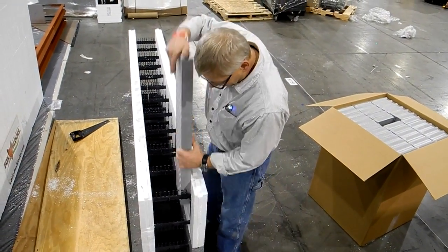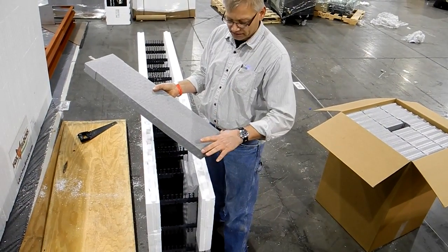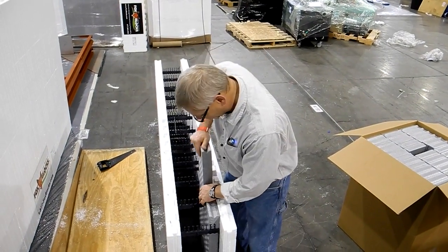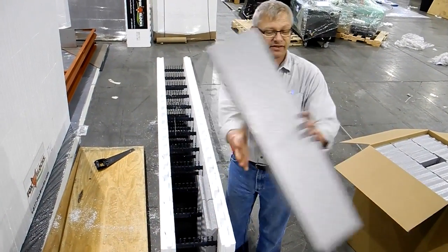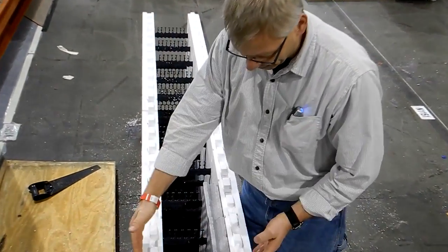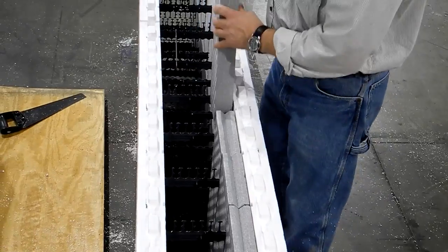Now look how cool this is — it fits down. It's actually built in a way that the bottom is a little bit narrower than the top, so it's easy to put in. It increases your man hours — you can just make money with this thing. I have just added R9 to this. When you place concrete in this wall, this is our 8-inch block, and this is going to give us 6 inches of concrete inside here.